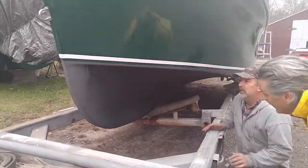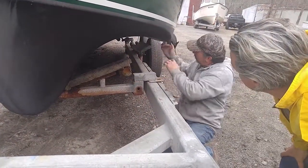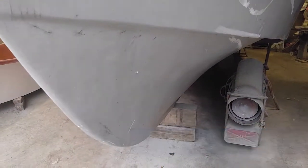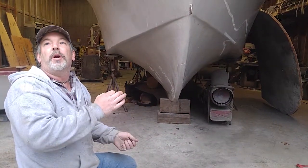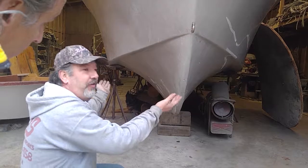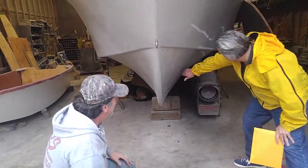Last time we looked at the hull of the ROS bass boat, which is an interesting design. Today let's look at the hull design of our 30-footer. How is it different? Well, the entry on this boat has more of a puffed outlet, which makes the bow a little bit more buoyant. We want the bow to come up out of the water a little bit more. As you look down the hull, it starts to flatten out like an old sea skiff style. It still has sort of these channels we talked about on the last boat, but not as pronounced.